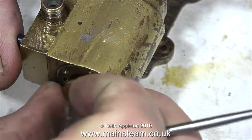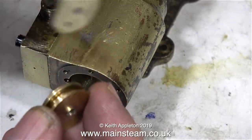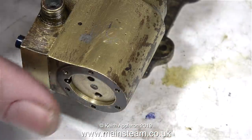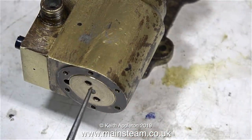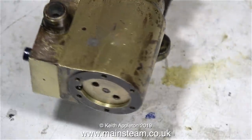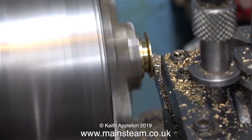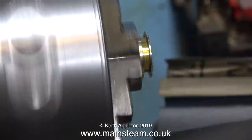In this clip I'm removing the test piston that I made — this was the thinnest piston I could fit. Look at it against the original; the original one is a little bit oversized, I think, so I'm going to have to machine that down. I did after all machine this original piston to no specific dimensions anyway. I don't need it to be very tight into the crosshead for the test. It turned out that this piston is a little bit too big, so I'm machining it down — first one end, then I reverse it on the rod and do the other end.